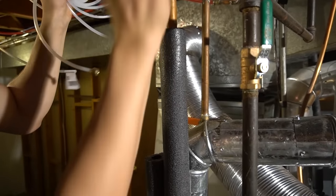By the way, the saddle valve, the needle valve, I should say, has instructions on the bag of how to put it on as well. So here's the control. The knob just slides off. Then you take it apart. There's the gasket. You could take the gasket off for now. And then there's four holes right here. You put your sheet metal screws through there. So I'll be cutting out a hole and then just putting that in here.